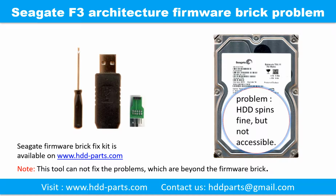Firmware break is a commonly known problem in Seagate F3 architecture hard drives. The symptom is the hard drive spins fine, but is not accessible by any computer. We designed a special kit to fix this problem. The kit is available on www.hddparts.com. Please note, this tool cannot fix problems which are beyond the firmware break.